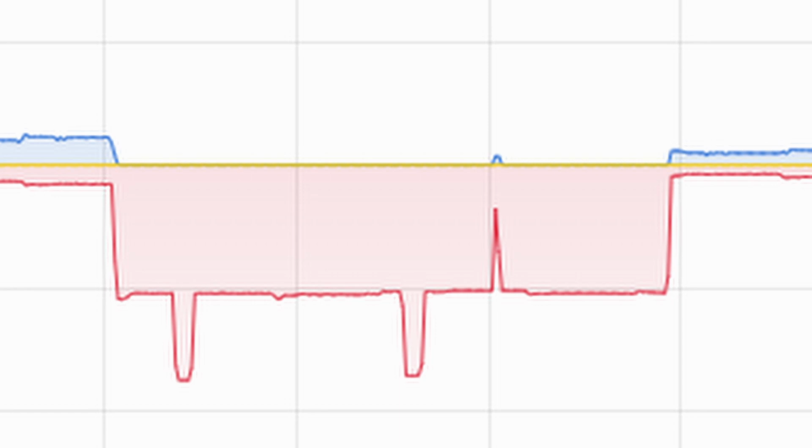Now, unfortunately, this also means that during the day when the sun is shining, I can only charge it up to 100 amps from the inverter into the battery. But with an 8.3 kilowatt array, and I'm using stuff during the day as well, 100 amps has been fine for me.